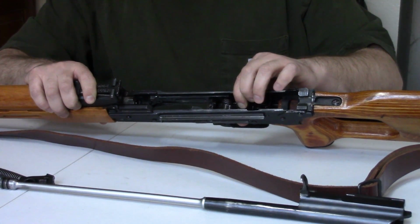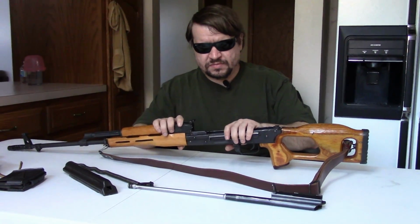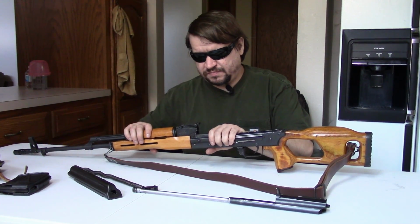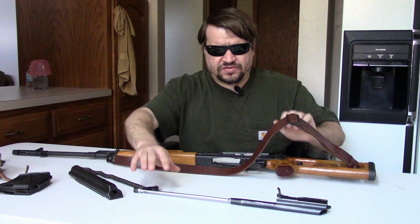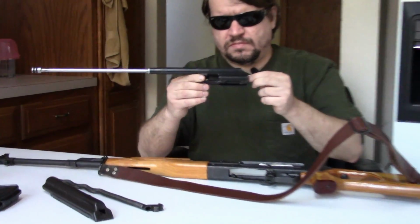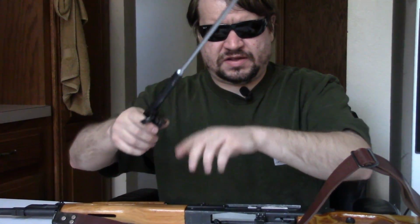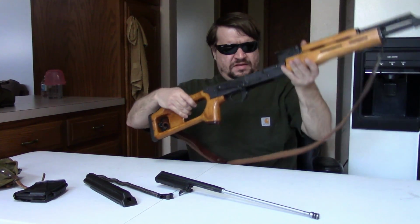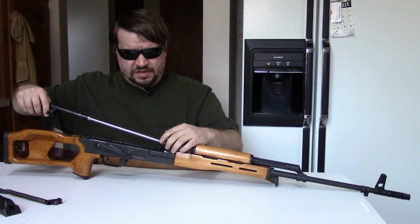Now I say rebuilt because you would think, being a semi-auto only, there wouldn't be a lot of import problems because we have a thumbhole stock. The early ones used the fixed flash hider, and originally they would shave or otherwise demill the bayonet lug. And only fed from 10-round magazines. No problems, except for that auto sear, the out-of-battery safety we talked about. The ATF has considered the out-of-battery safety to be the machine gun, specifically the hole it rides on. So even though the PSL was a semi-auto only, always in Romanian, they still had to rebuild these in Romania on new receivers lacking the pinhole.